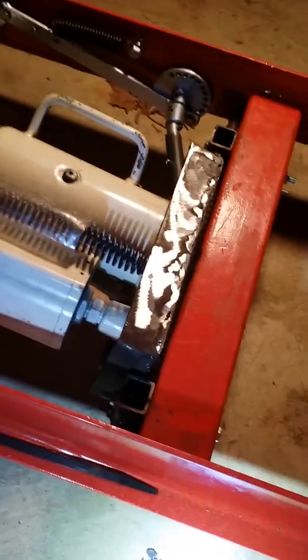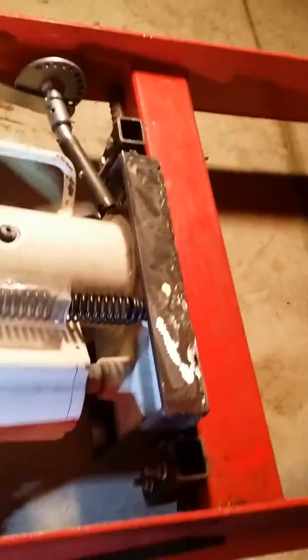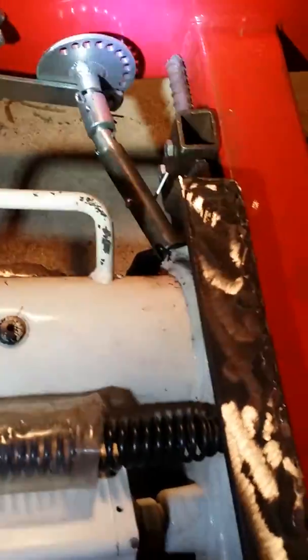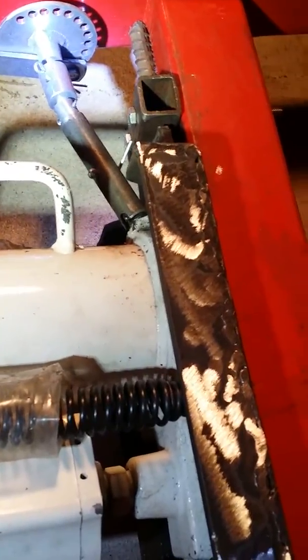What I did with my cradle — it's inch and three eighths by a quarter inch steel stock and I made the cradle eight and a half by five and a quarter inches. I got an eighth inch steel plate on the bottom of it and used pretty much all the original hardware that came with it for the relief valve hinge.